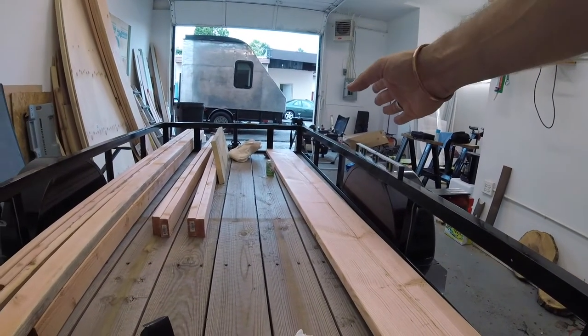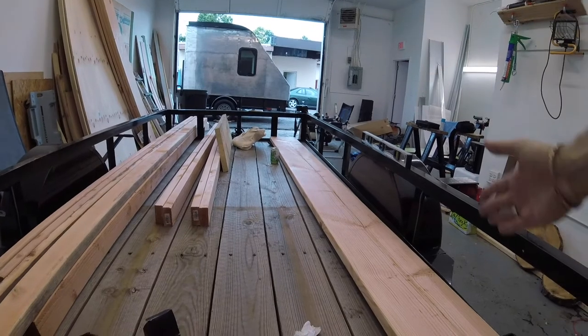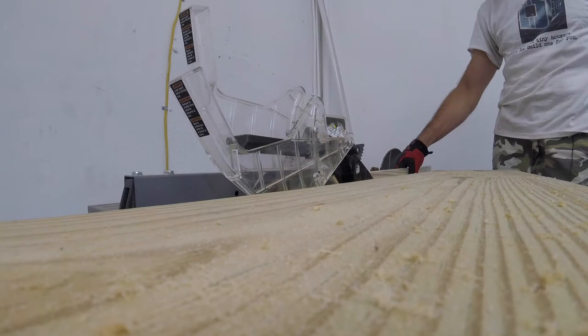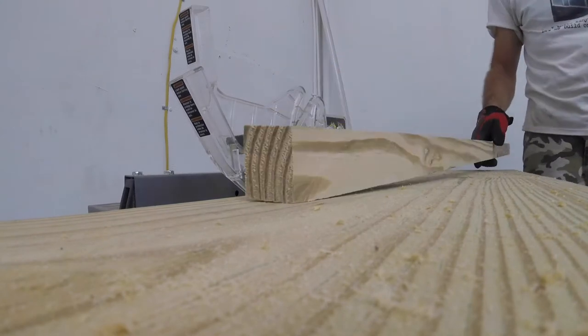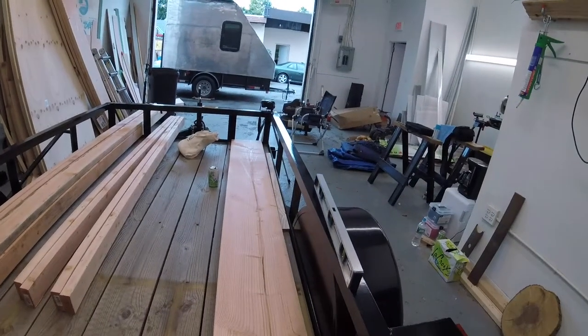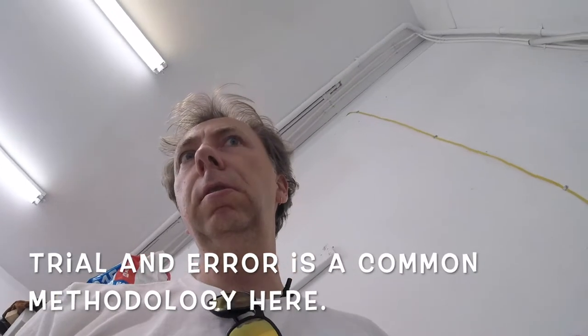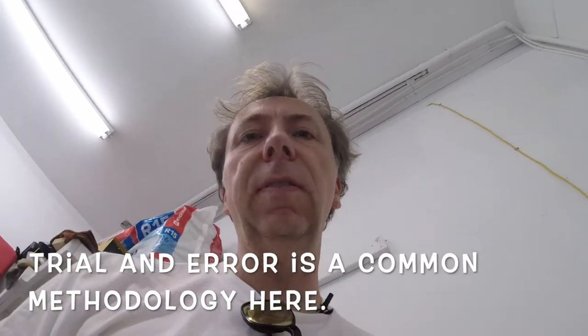So what's going to happen is one five-eighths cut and then one inch-thick cut, and then we're going to put it on there again and see where we're at. That five-eighths piece — it was actually pretty darn good except it's a hair thin, so we're still not really hitting the top of the angle iron. So we're going to cut it just a touch thicker — maybe three-quarters. I'm going to try a three-quarter piece and see how that works out.